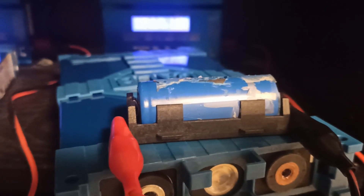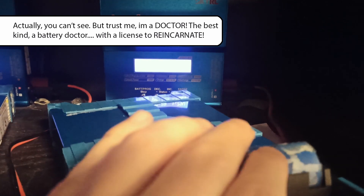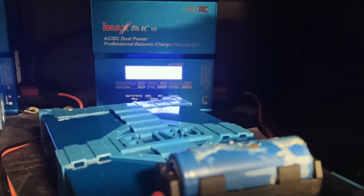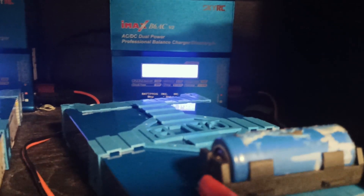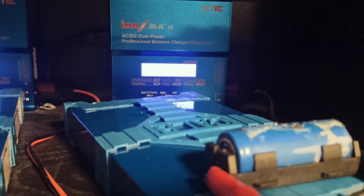It seems to do it in stages: 0.8, 1.35, and now 1.62. As you can see, it's increasing rapidly, which is a very good sign that this cell wants to live. I usually feel it to see if it gets hot, but since it has such a low internal resistance, I don't think that's gonna be a problem. Just a few minutes on the NIM on the B6 should be enough to get it up to a voltage where we can actually test it in the MC3000, which has a built-in temp sensor. I'm also gonna see that it can actually still hold the voltage we are putting into it. If the voltage drops down immediately to 0.15 again, then this cell doesn't wanna live. But if it actually holds most of the voltage, it does wanna live.